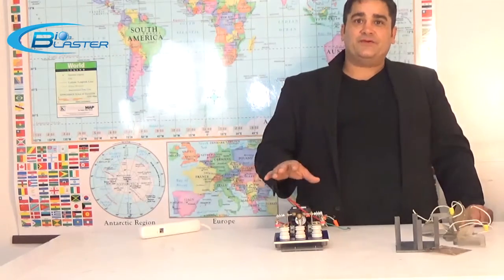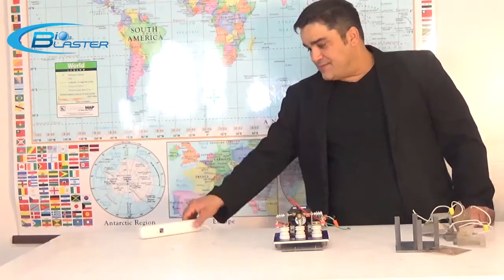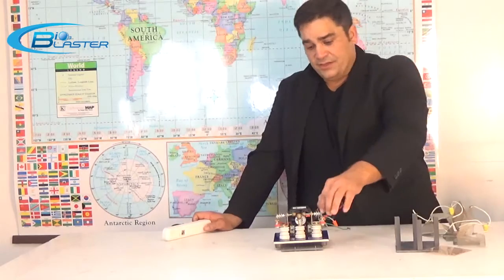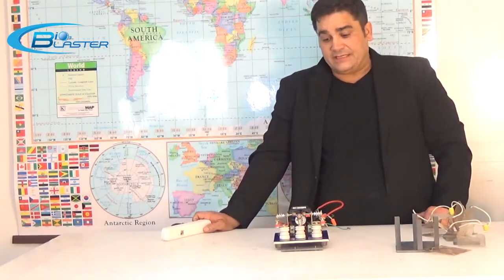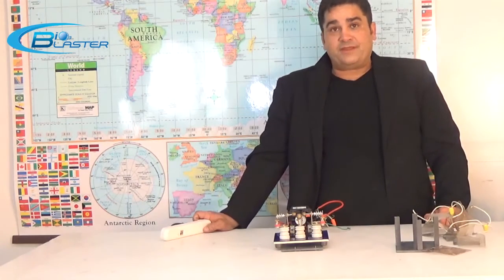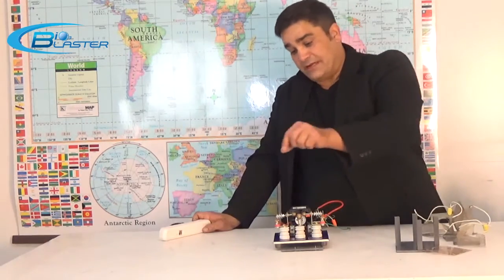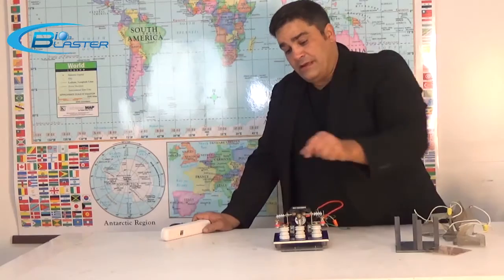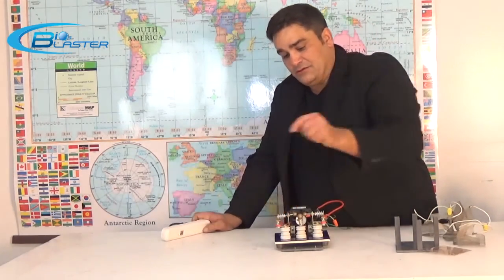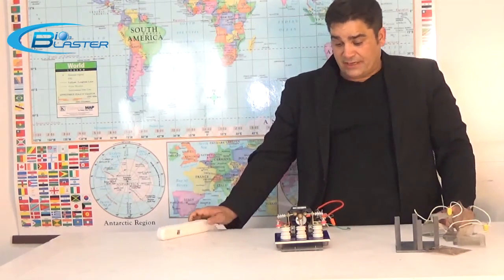Now I'm going to tell you about the beginnings of how I started to build ozone generators. The main method is called corona discharge, and that is where you've got two electrified metal substrates with a dielectric media in the gap. In this case, the dielectric is air and you get a spark gap that causes a spark to jump across that dielectric media.